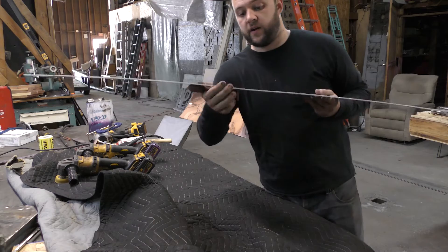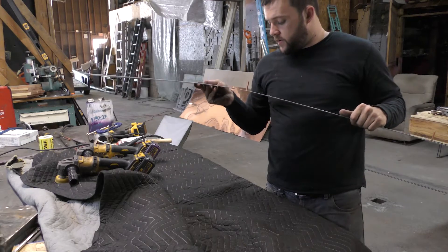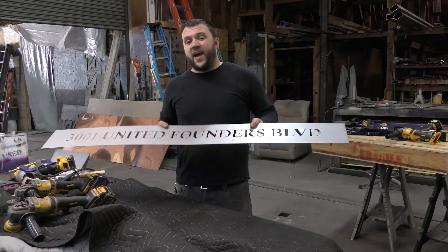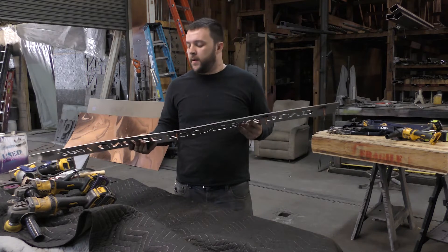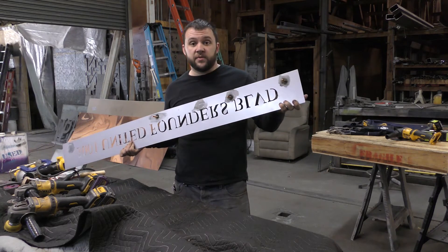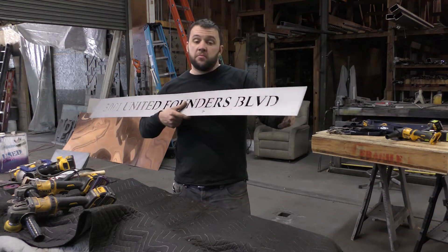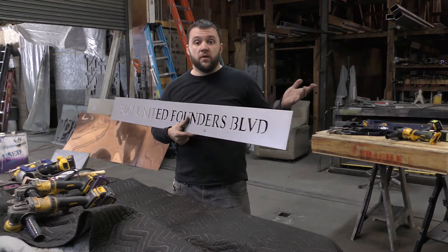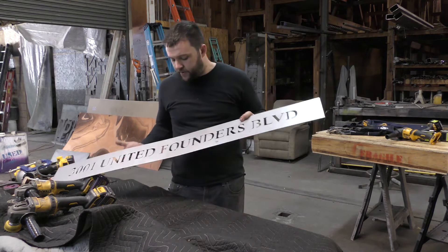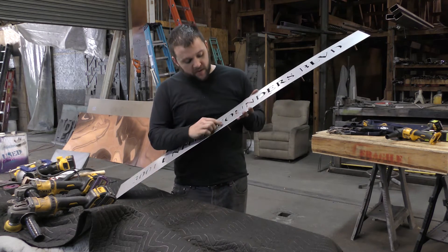This one also left just a little bit of discoloration on the face — that's not something I'd find acceptable. So it really is about 50/50. If you messed a job up and needed a stud on your sign — something going flush to a wall — this would be a good way to attempt a repair before rebuilding. You can see on this one it's fine; you wouldn't know it's there. This one got a little hot, and where we chemically removed the powder coat, there's definitely a burn spot.